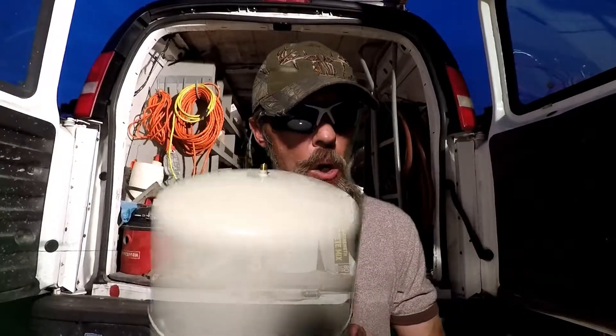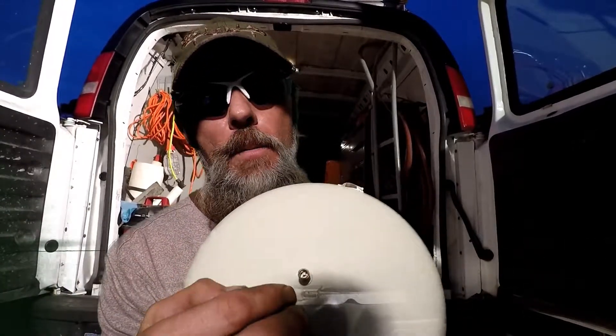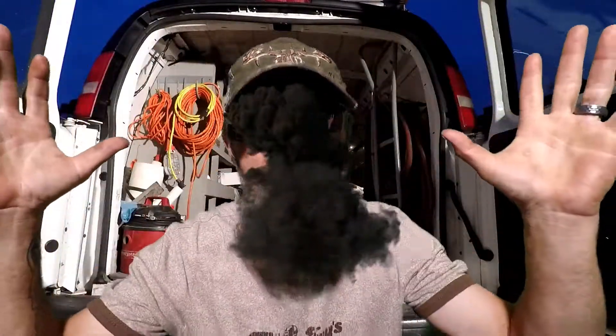These things are great — I totally advise everybody watching this to make sure to have one installed above your water heater, but they don't last forever. The usual lifespan might be about three to five years. How do you know if it goes bad? Remember that Schrader valve on top? If you push the little pin and you hear air, there's air in there — that's good. But if you push it and water squirts out, the tank is shot. It means pressure has gotten up inside and blown the bladder apart, so it's not serving any purpose any longer.